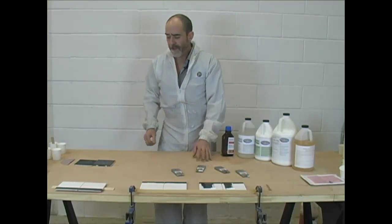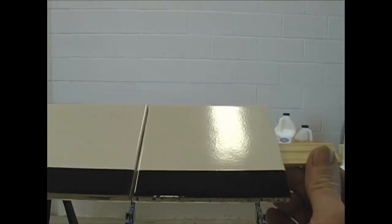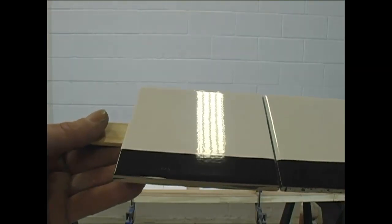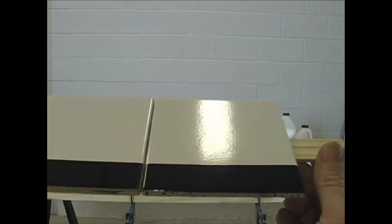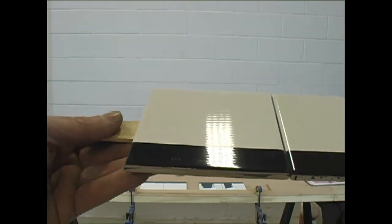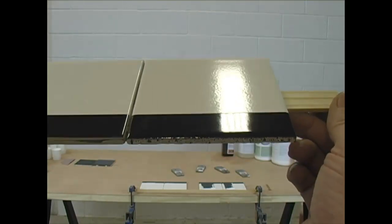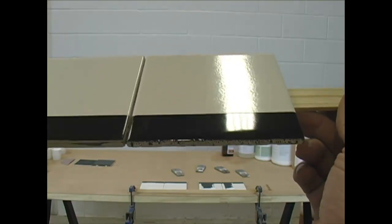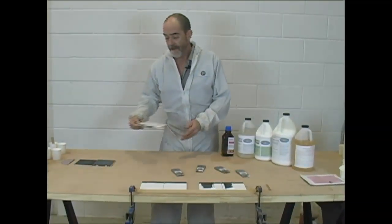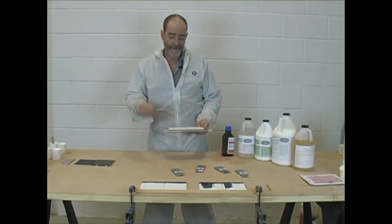The performance value is greatly improved using Tub Potion number 8 along with the polyester bonding primer — it's just incredible. The one on the right is the epoxy, and you can see the reflection from the lamp in the ceiling. Look at the clarity difference as we go to the polyester: it's much cleaner, much flatter, just a much cleaner looking shine, much more resembling the original porcelain. As you can see the shine on the glaze tile is equal on the coating, but as you come over here it becomes foggy and there's a texture to the coating. The epoxy polyurethane coatings just don't quite have the same effect as the polyester does. You get a much, much nicer look and much improved adhesion — aesthetically and performance-wise, it's just a superior product.